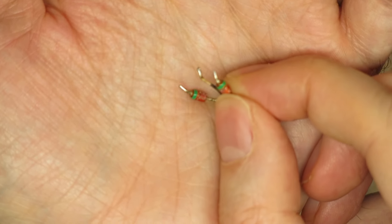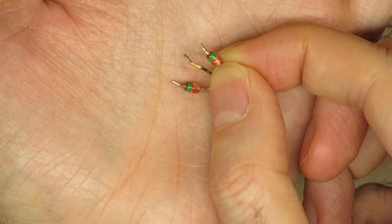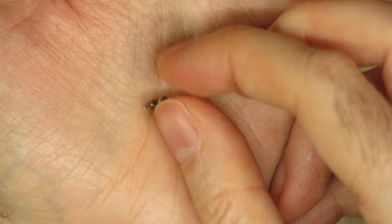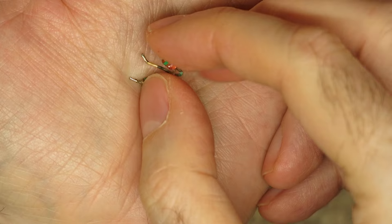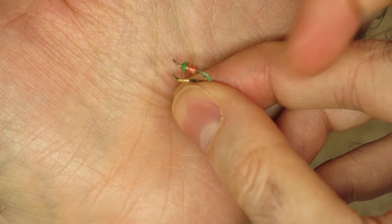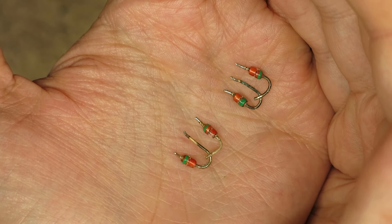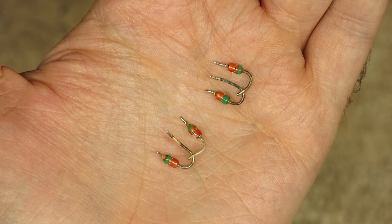There is some corrosion at this filter — these are basically ceramic capacitors back-to-back — and I think there's corrosion at the bottom of one of them. Because they're ceramic I'm not worried about them shorting, and I think this one is barely in the circuit now anyway. I think it's just for filtering noise when using a 9-volt power supply. The legs are a little bit folded over and if I keep trying to mess with pulling things out and heating up this area I'll start lifting tracks. So I'm just going to leave that — it functions, it works.